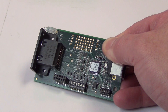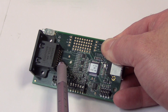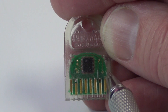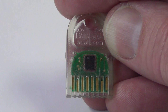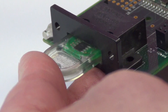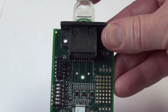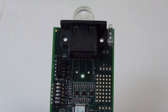When integrating a DataKey serial memory token into an embedded design, it's really a straightforward process. The lines from the receptacle simply run to an SPI or I2C port on the microcontroller. Each memory device and receptacle also have a special contact used to detect when a token has been inserted or removed from the receptacle. This is called the LOFO line, which stands for last on, first off. In a serial memory token, this LOFO line is internally tied to ground. The LOFO line from the receptacle is typically tied into an interrupt line on the processor. So when the token is inserted, the line is pulled low and an interrupt is triggered. Once the memory token is detected, power is applied and communications can begin. At this point, communicating with the inserted memory token is no different than communicating with an equivalent EEPROM that is soldered to the board.